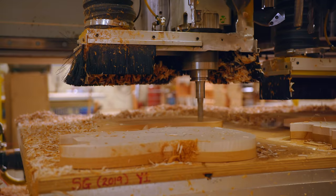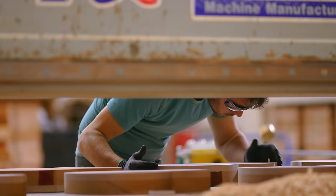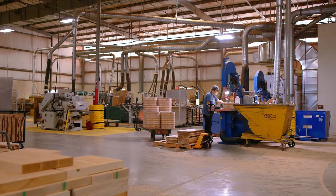It just made life around Gibson a lot easier when we started getting CNC machines in — they were more consistent than most machines. In the old days, before CNC, we had pin routers. You had one operator moving a template and the body over a moving router cutter. Not only is CNC higher capacity and higher accuracy, but it's higher safety, and that's most important for our employees.